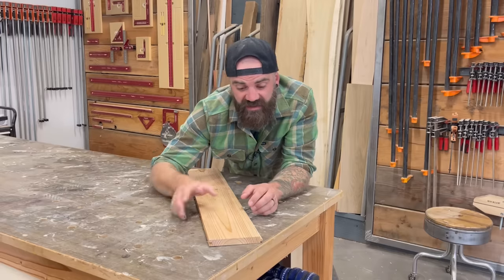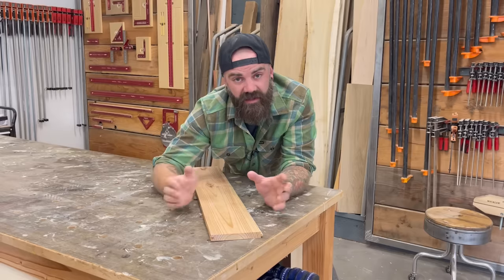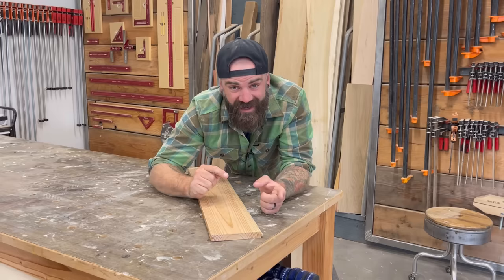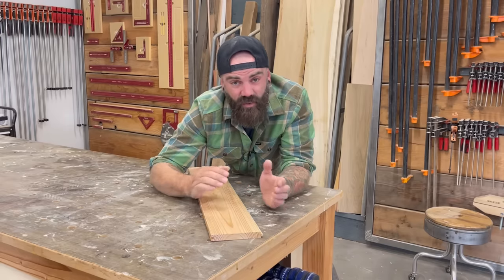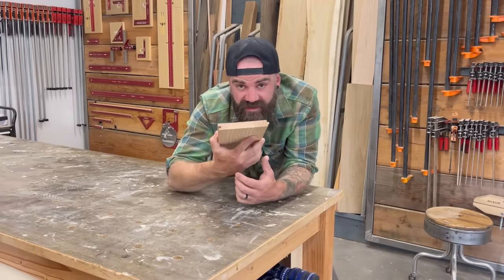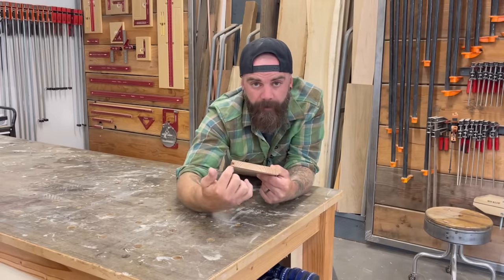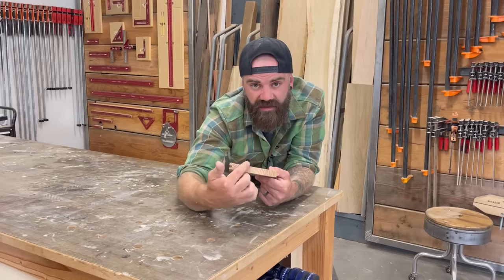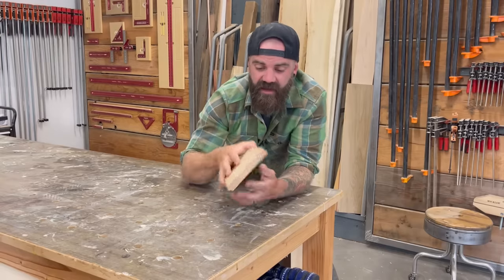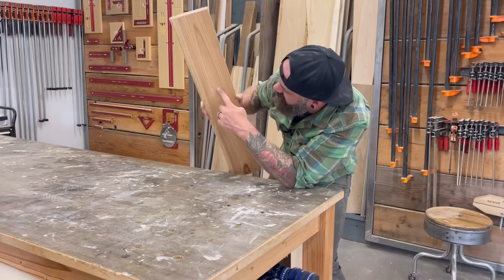There's an easy way to tell which way the grain is running. There are two sides of the board: the bark side — the side that would have had the bark on it — and the heart side, the internal side of the tree. The grain direction changes depending on which side you're dealing with. To determine the bark side, you look at the end of the board. See how the rings curve? Think of how a tree grows: the outside of the ring is the bark side, the inside of the ring is the heart side. Next, look for these cathedrals — these big pointy shapes on the wood.